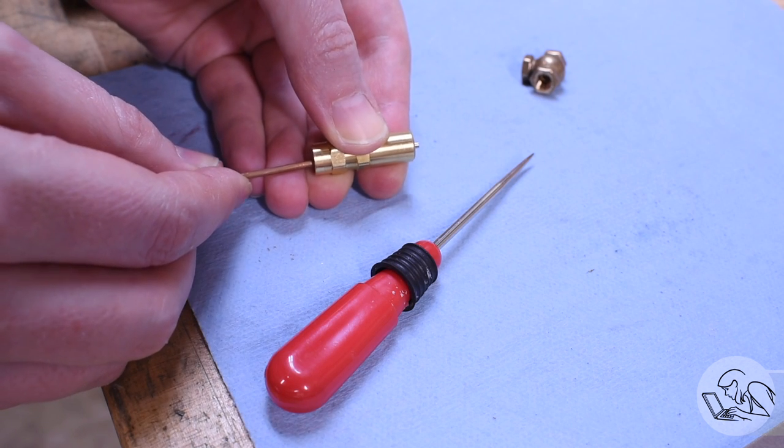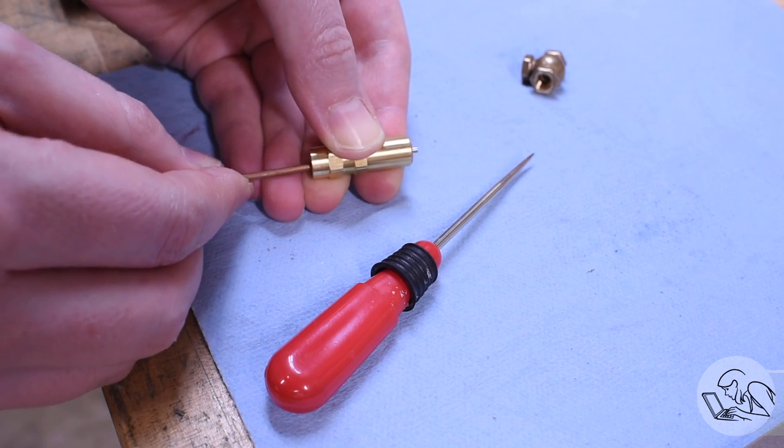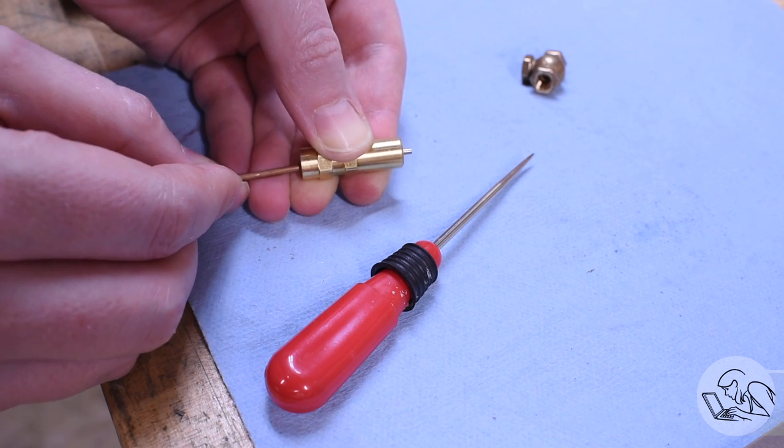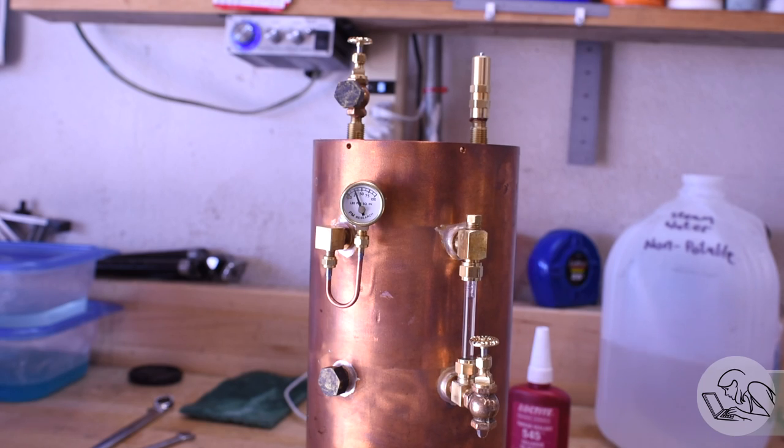This ball carrier actually does two other important jobs. It creates an interference just above the orifice so that when the spring starts to compress under pressure, steam accumulates under the ball carrier, creating a little pocket, and that creates the popping-open effect — a buildup of steam rather than just letting it seep out and cause the valve to open slowly and clumsily. Kozo-san recommends a little annular groove on the bottom of the ball carrier to amplify that effect. Then it does the same thing in the other direction: as the valve is starting to close, the space above the ball carrier creates a little pocket where steam accumulates and builds back pressure, and that's what creates the force needed to pop the valve back on the seat. Just testing the ball lift here with a piece of copper wire — that looks good, should have enough travel for steam to evacuate. It's certainly a lot more complicated — let's see if I've actually made it better.